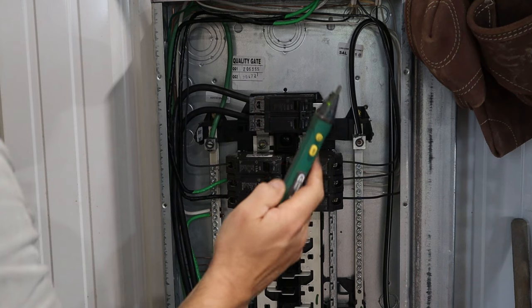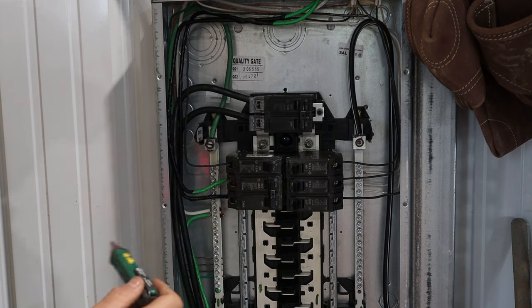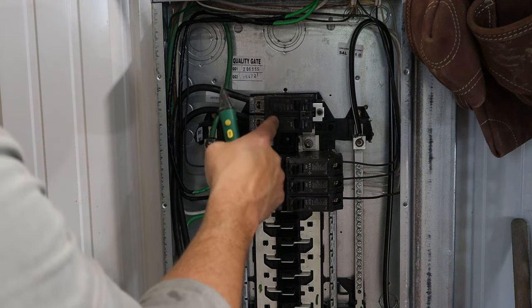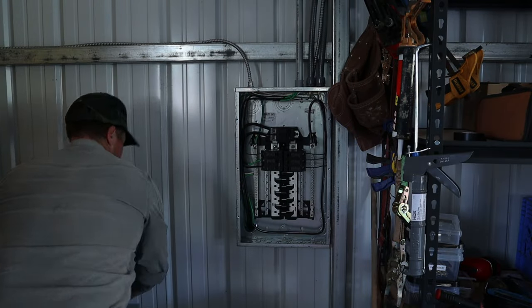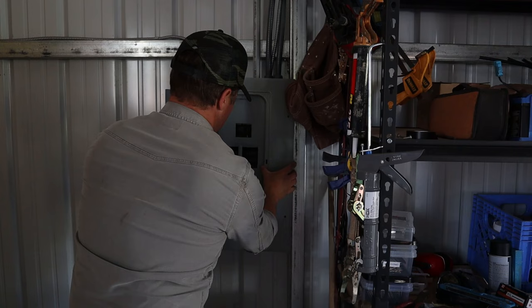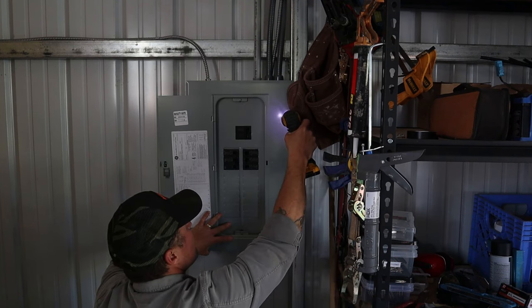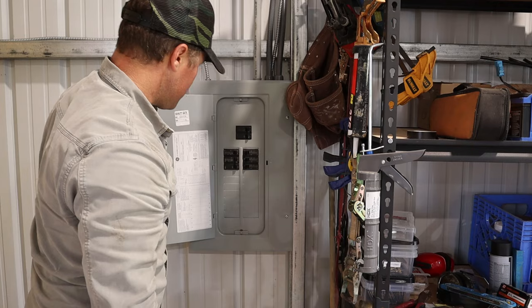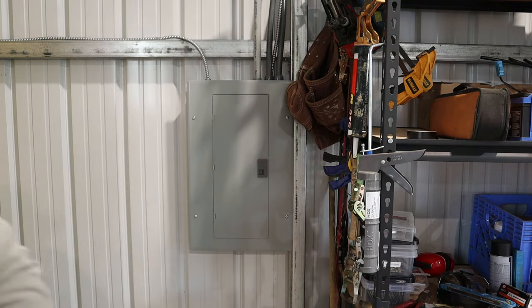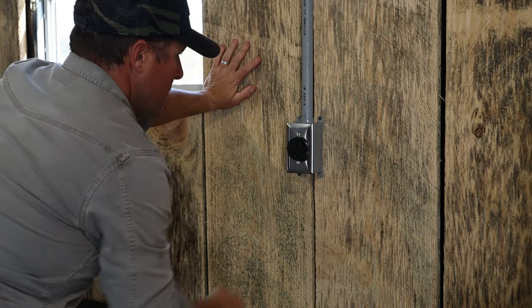The panel is back on and powered up. We have our electrical tester — we will test the power coming in. We do have power coming in, and here's the 40 amp breaker we installed. We'll test the two legs going out — and they are hot. So I'm going to kill the power on the sub panel again, install the panel cover, secure all this, and then we'll go check the receptacle. Power back on, everything is hot and secure. Back at our welding receptacle we will test it. Success.